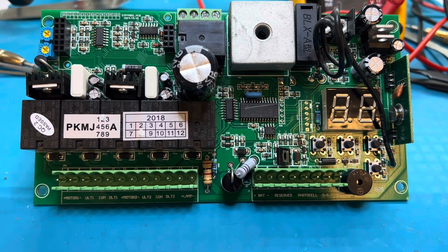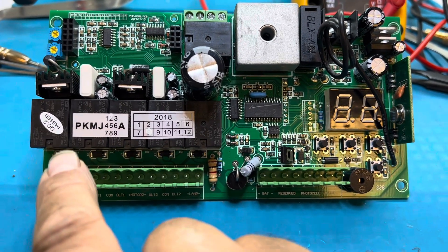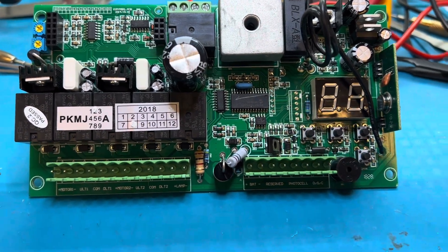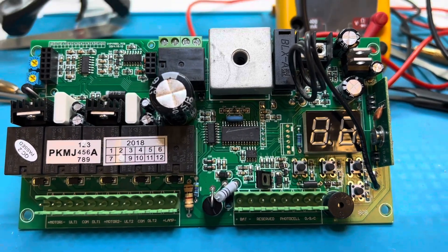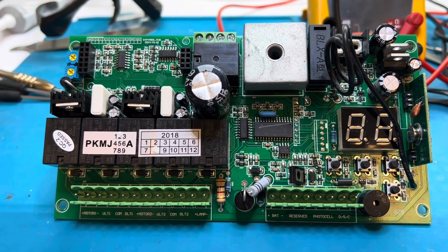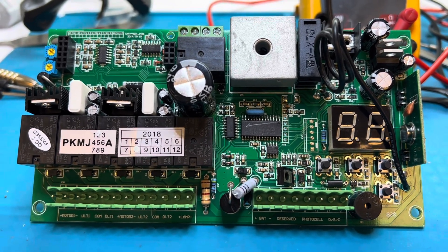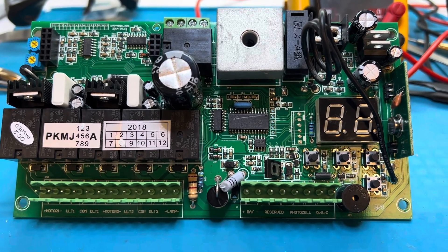Going back to it — sometimes you may have a relay that goes out and it's not triggering the gate to open or a mechanism to happen. There's a lot of those types of things that can happen. A piezo buzzer can go out and it's not making the buzzing or horn sound you want coming from it. There are a bunch of little things like that which can cause you a problem.